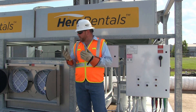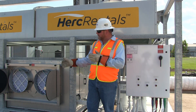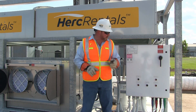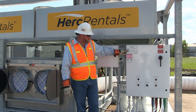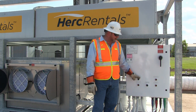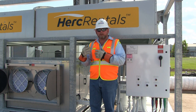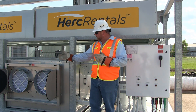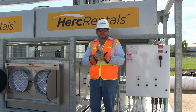Just to recap: we started by setting the unit in place — in this case using a forklift — and verified the weight tag and center of gravity for our lifting capacity. Next, we verified power requirements: 172 amps minimum circuit ampacity and 225 amp MOCP. We hooked up our power — our phase was backwards, but we corrected that and are now properly phased. We primed both P-traps — the 80-ton has two. We ducted two of the three available supply connections. And for this installation we're doing 100% outside air intake, taking in 95-degree air that will leave at 55 degrees on the other side. Our next step is startup.